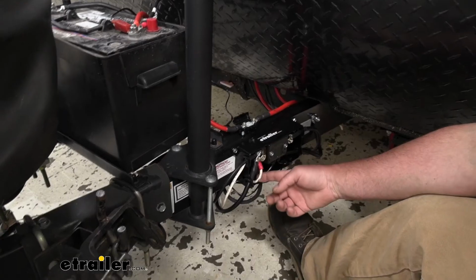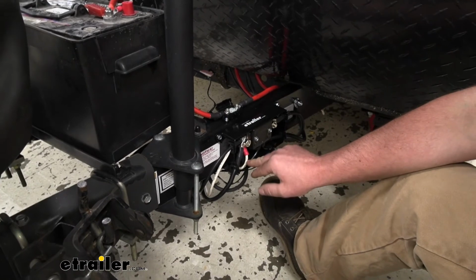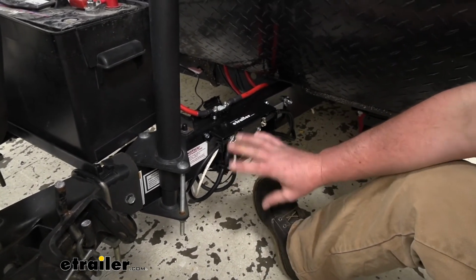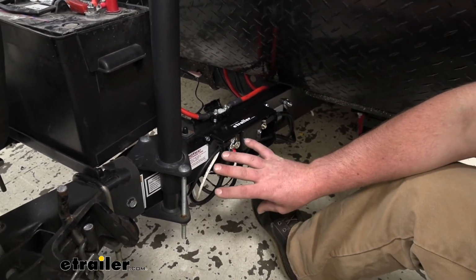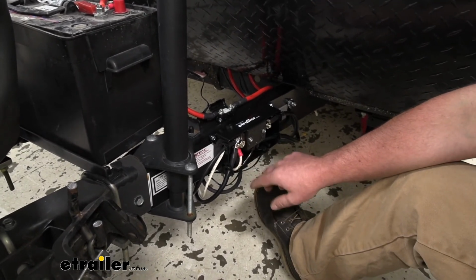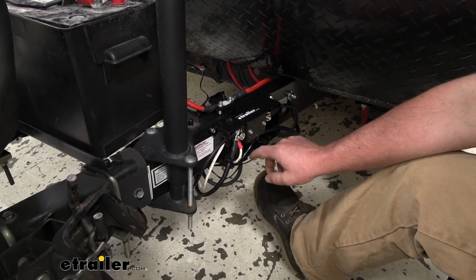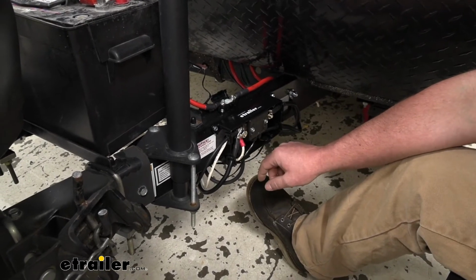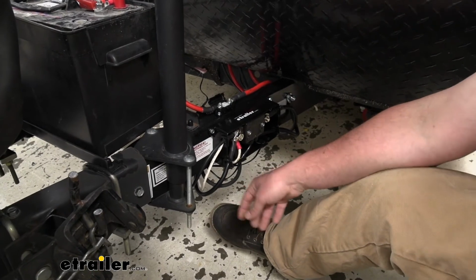This white wire here, that was the original ground wire that went to our battery originally before any of this stuff was on. So like I said, the way your trailer, or camper rather, is set up now, you're going to take the wire that goes to that negative post originally and also put it on this one here. So essentially all the grounds, more or less. That leaves us with two more wires. We're going to have this one here and this one here.